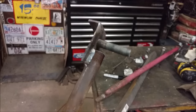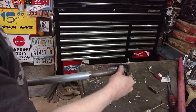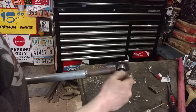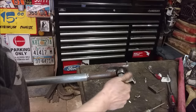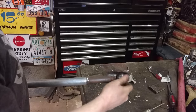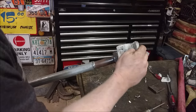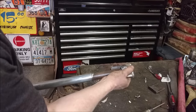So we've just welded it on. I trimmed the bolt to an adequate length using my technique from my bolt cutting video, so the nut threads back on cleanly — if you just chop them off and then try to thread it on, you fight them. So that's all set up. Now I can take my piece, put that on, put the screws back in, and this side is done.